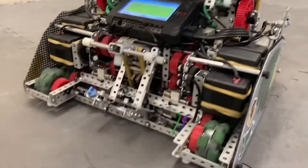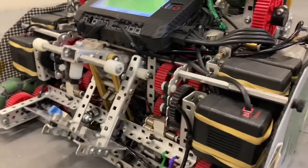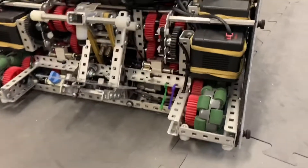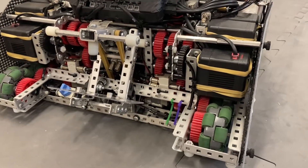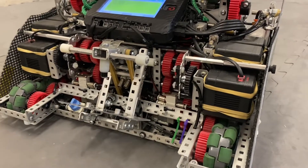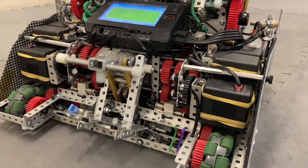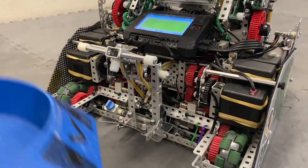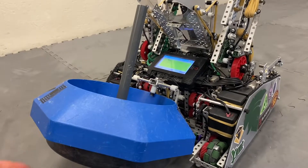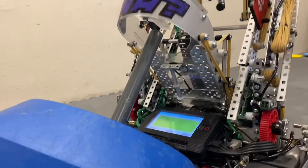The next thing to talk about is the back baselift. It's a pretty standard 2775J mech — really no different than theirs, with a few modifications to get it to fit on our robot. It uses the same pistons to clamp as it does to tilt it back, so we're saving air. We can open it up like that, slide a base in there, it catches on and lifts it up, and then it pushes it right up into the ring mech so we can load the rings and score many rings efficiently.